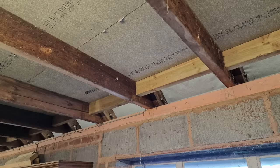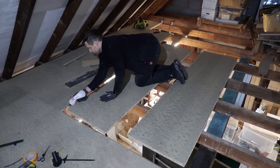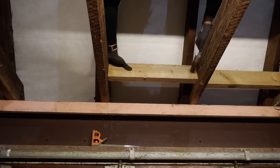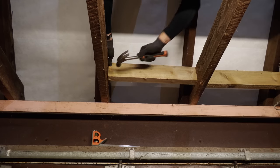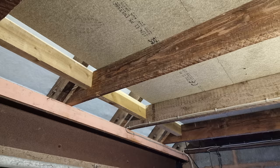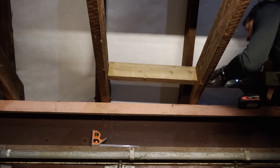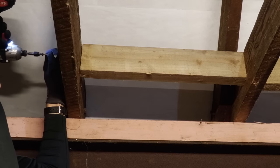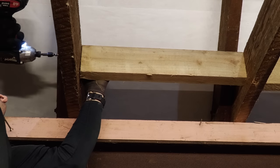It's a good idea to add perimeter noggins too — both to strengthen the joists and to add support to that long unsupported edge of flooring. So I set about adding noggins as I was laying the floorboards. But because of the issue of starting the flooring too close to the rafters on the other side of the room, I'm going to have to either move the noggins or waste a few remaining sheets cutting off the tongue and grooved long edge to fill the gap.